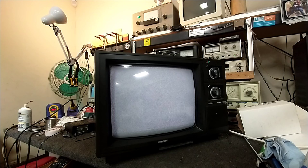And if the jungle is bad, then we're kind of stuck. If the tuner is bad, well, you can substitute a tuner, but finding one that'll work in the circuit is a whole nother thing. So I need to find my tuner subber. We seem to have fixed the light to dark problem, which is good. But until I can get a signal into it and figure out why the tuner isn't working, there's not a whole lot left to do here.